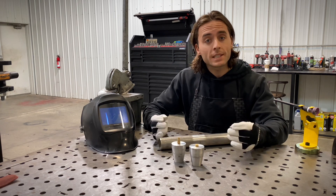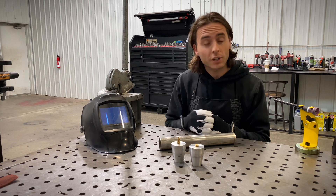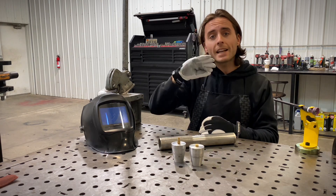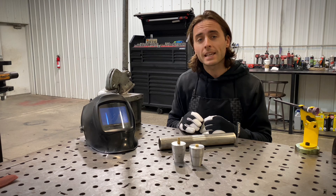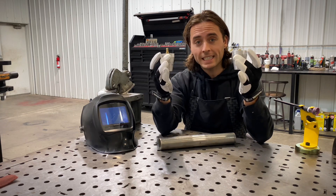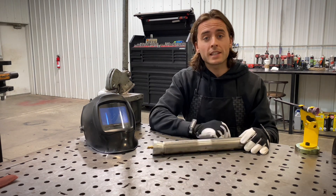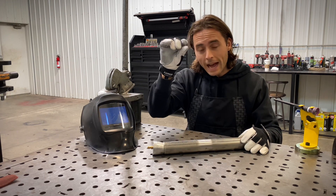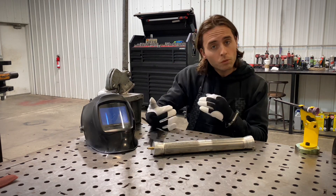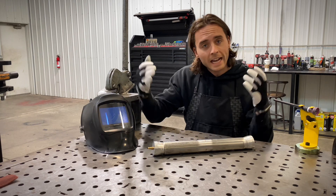What is back purge for those who don't know? Back purge is when you fill the inside of your part with argon — the same welding gas you're using through your nozzle — so there's argon on the underside of that weld to shield it from contaminants. It keeps the weld clean and really strong. We use back purge pucks with fittings on them that go in each end of your part and get sealed off. There's an extra line on the regulator to adjust your back purge CFH, and you clip the line into the fitting so it fills the inside of your part while welding. For a small part like this, I'll only use about three or four CFH of argon to fill the inside.